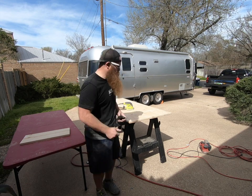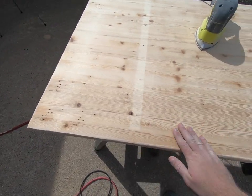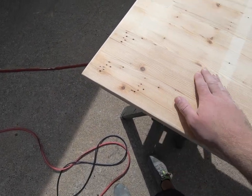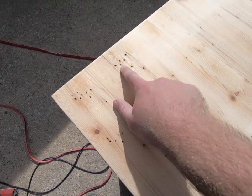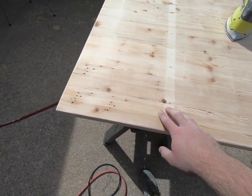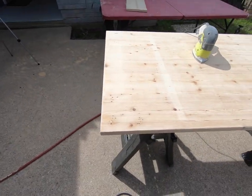I'm going to bring you in closer. Looking at the bottom of the table — it's really smooth and stripped, ready for whatever stain or paint we put on. I want to show you though, they had used this as a multipurpose table for a long time and you can see a bunch of screw holes where they had put legs on it in different places. Even though this is on the bottom, I'm going to go ahead and fill these with wood filler and sand it down to give a perfect finish on both sides.